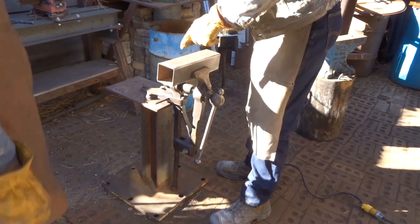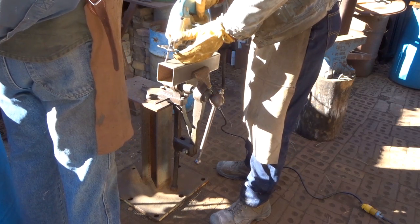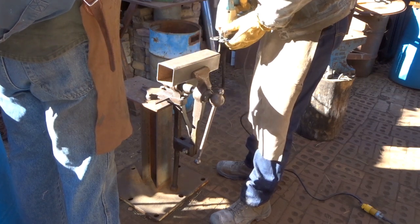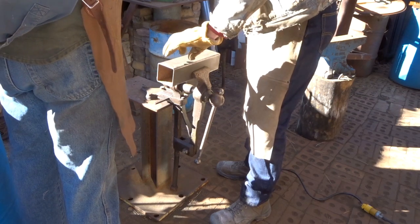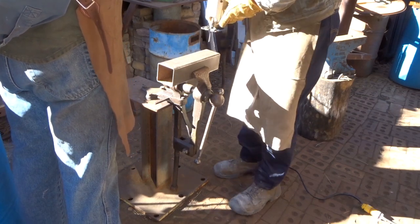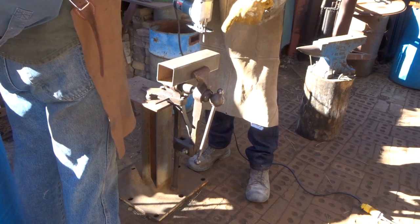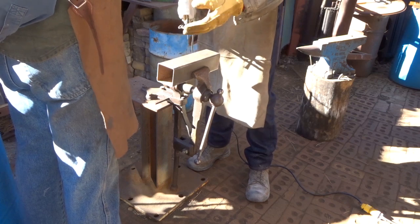As you're cutting, cut down here and get to about an eighth of an inch from the hole. Then do the next one, and then do the next one, and then do the next one, so that it's still held in on all four corners. Then you can go back and from each hole, go back to where the cut is, and you won't end up with this thing flopping around and being a problem while cutting.